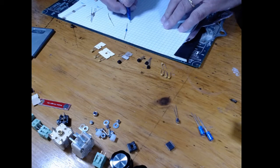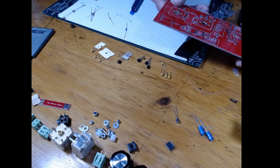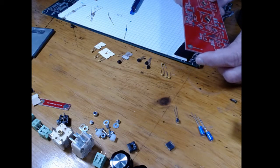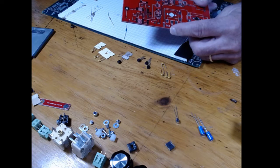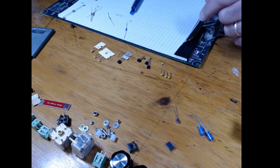Now, here's the case where I don't have the documents in front of me, so I can't check it. But if you check, by process of elimination, you'll probably figure out what that one is. I don't have that memorized, but if I look at the circuit board, I can probably very quickly find that it has a 10K, 4.7K, 18K, 18K, 4.7K, 10K. I'm looking. 10K, 1K. Yeah, so that's probably the 1K resistor.